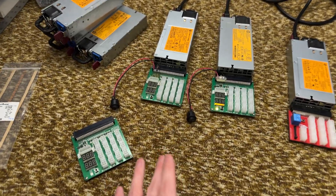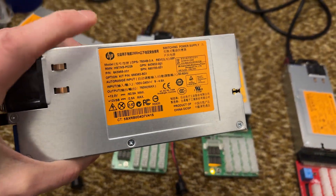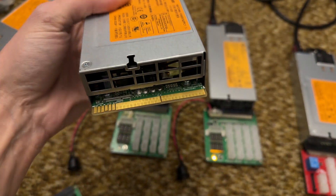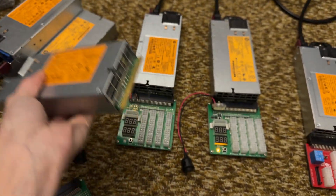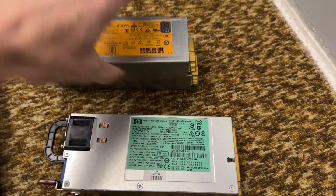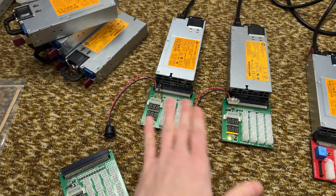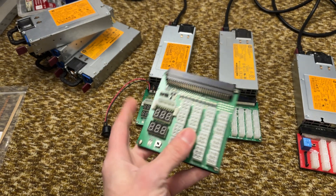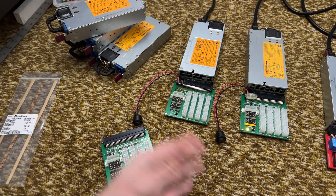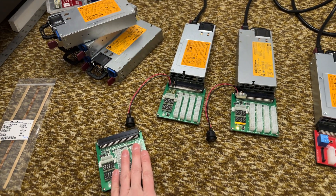This covers only HP common slot power supplies — typically HP branded server power supplies. Anything that looks like this on the back is called HP common slot, not to be confused with HP flex slot, which is slightly narrower. But this turn-on modification should work with any breakout board for HP common slot power supplies, including any Chinese no-name brands and any Parallel Mine brand ones.